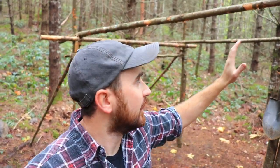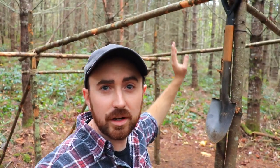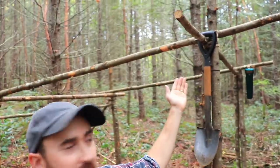Today I'm going to be using both saws while building the roof structure, collecting a bunch of poles and getting as much done as I can before the weather gets crazy. For reinforcing the structure — it's not that it's wobbly, but it does need some triangles. I'm going to go across with one long pole down there, and then do a few in the corners so it's more stable, and when I put the roof poles on top there'll be less wiggling.